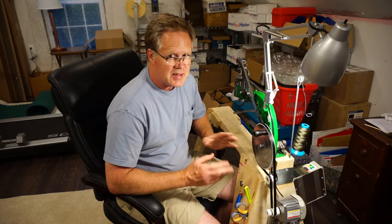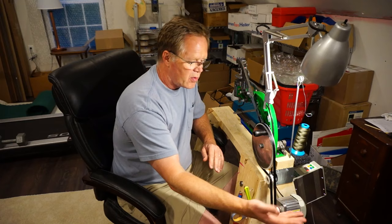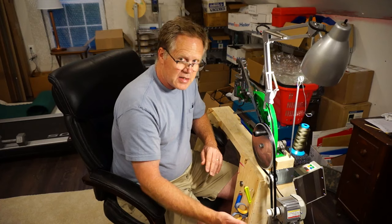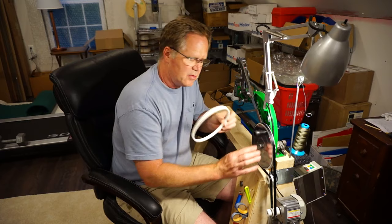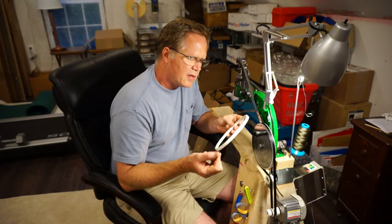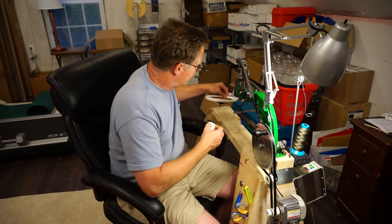This thing does everything I needed and a lot more. I had purchased a three-quarter horsepower 600-watt servo motor in anticipation of having a Sailrite machine, so I decided to go ahead and 3D print a ring that slipped right over the existing mechanism. I adhered it with five-minute epoxy and also printed this part — it has the keyway and everything.